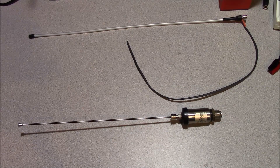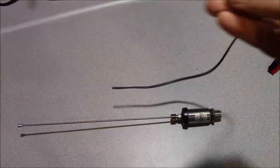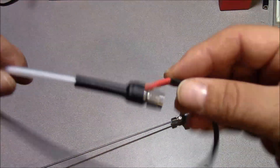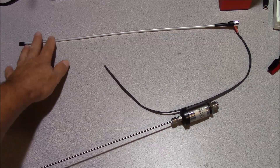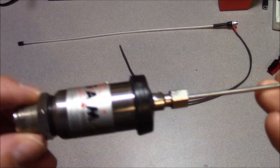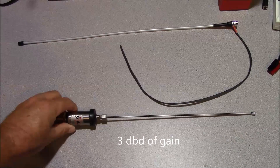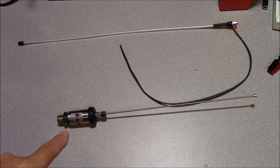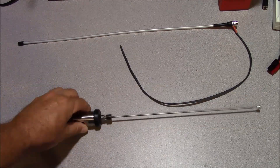I'm going to add a couple of exotics to this test. The first is a homebrewed antenna I made years ago — just a quarter-wave VHF with a counterpoise built in, all soldered together and heat shrunk up. I used to use it on my FT-50 and it works really well. The second exotic is a Gamma Electronics UHF antenna — a ground-independent antenna of all stainless steel construction. They're USA made, fantastic antennas typically used in alarms, and you can hide them just about anywhere — put feed line in and the thing is light and compact.